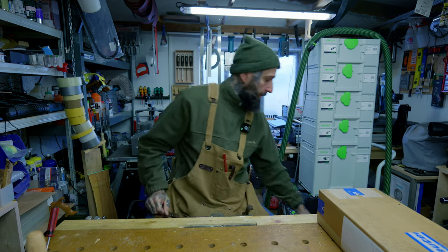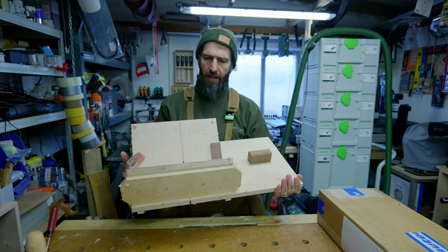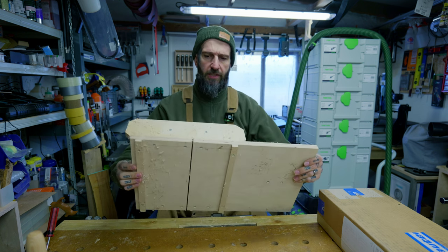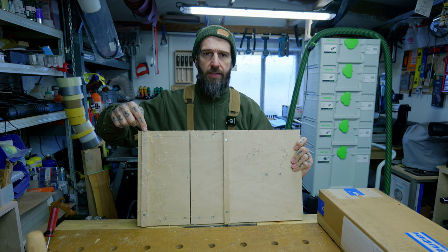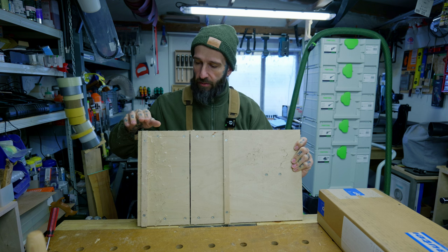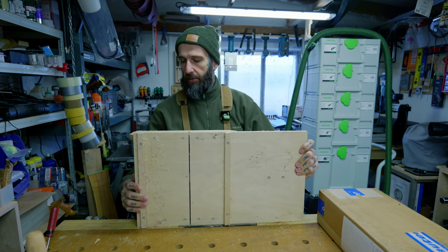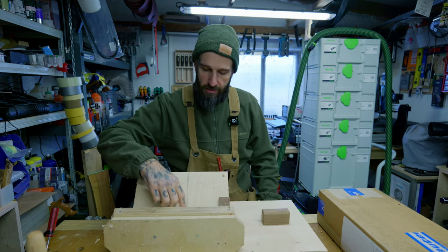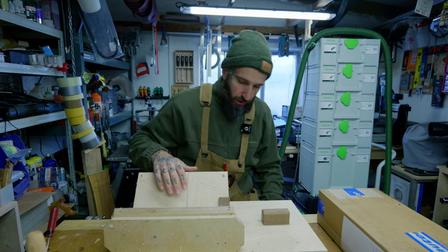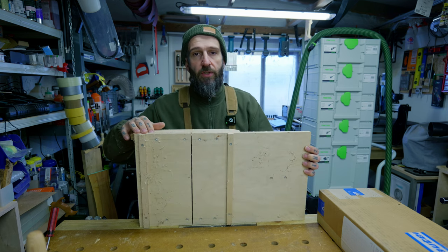Basically, I'm upgrading my old spline jig. There are a couple of reasons: this was for my table saw and it had tracks fixed to my old table saw. My new table saw still fits, but I wanted to upgrade it. This kerf is set for the blade on the table saw, and I wanted to start using it for my router as well, which these T-tracks wouldn't allow.